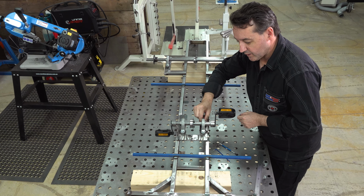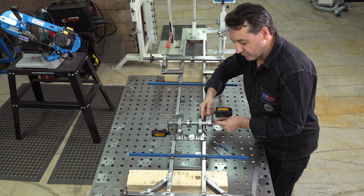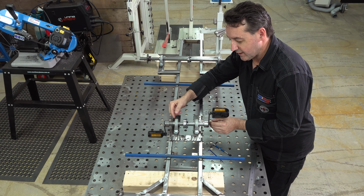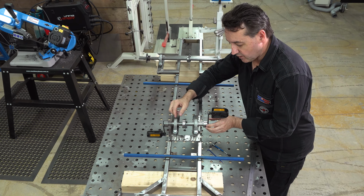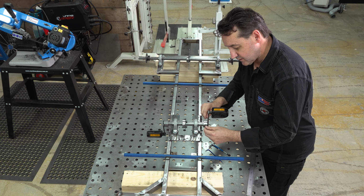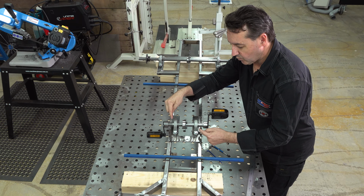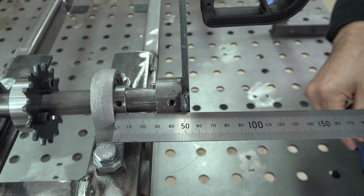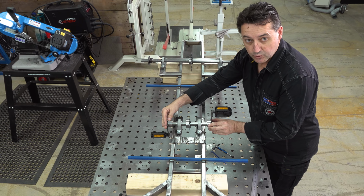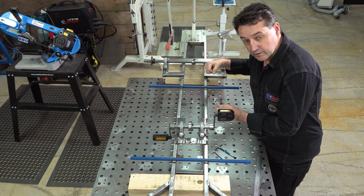To set up our front crank, we need alignment to the chassis, but we've got 2 points of variation here where we can get free play. So what we're going to do is we're going to measure from the bearing face out 54mm so that we can get them centered on each side to the bearing block. You then make sure your crank face is nipped up nice and flush and tight on both sides. We can then at 54mm lock in our grub screws on our bearing blocks. Make sure that we keep this free movement for when we fit our chain to get correct tension.